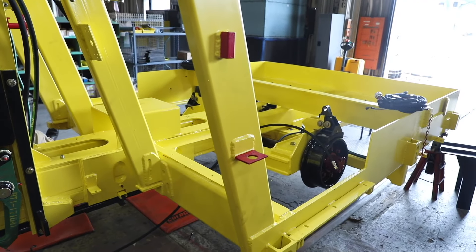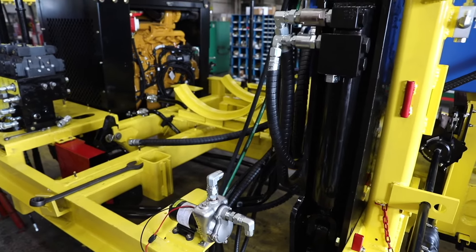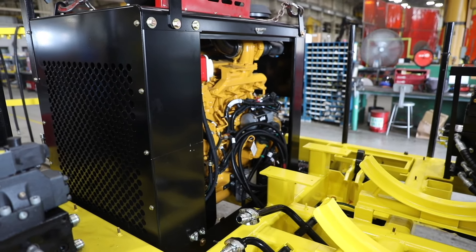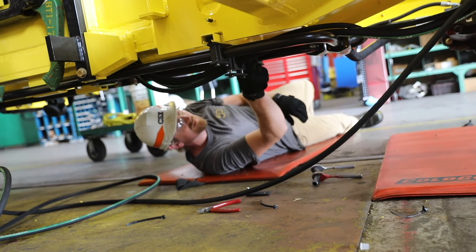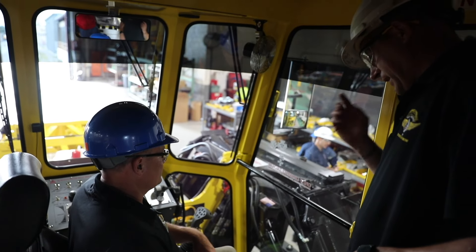Here's Station 1 Track 5. This is a white driver frame. The frame comes in bare. We put the axles, the brakes on it. We put the hydraulic tank. There's a nipper, a cylinder, a turntable. We'll put the engine, do a few modifications to that. And then we mount all these valve banks and manifolds here, run some of the hydraulic hoses, and try to do a six-day pull on this, and then go to Station 2.